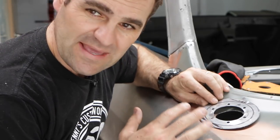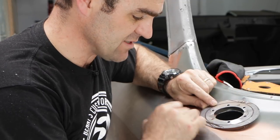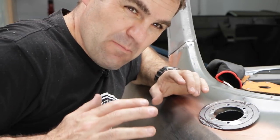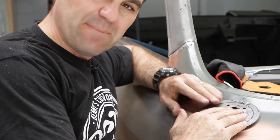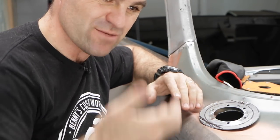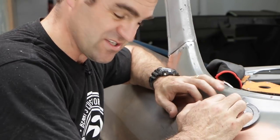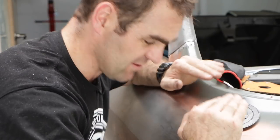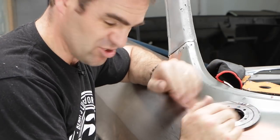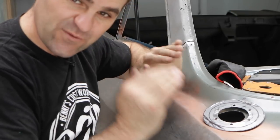So the way I've lined this up, I've marked out where I'm going to trim off the top and bottom because they're the highest parts of this current setup. My plan is to try and keep this a bit higher than the rest of the body — I've seen others try to sink these in, but the issue there is you've got to put drainage holes in to get the water out. I wanted this to sit higher than the rest of the bodywork so I don't have to worry about water rust issues. Let's start trimming off these bits and start tweaking it to get it to fit exactly flat where I want it.